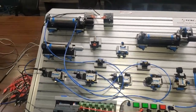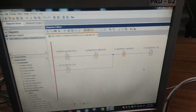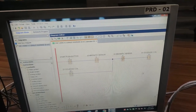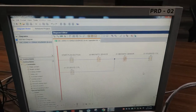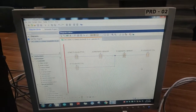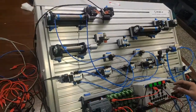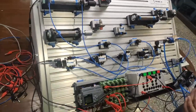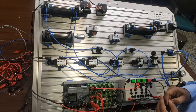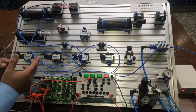This same cycle can be visualized in the PLC program. As I give the input I1, the cycle goes to the I2 sensor through the magnetic switch. In the simulation you can see the single cycle of the double acting cylinder working. We have performed the double acting cylinder control using PLC and a single solenoid 5-by-2 valve.